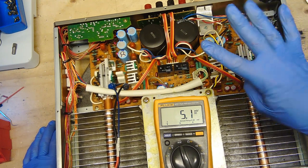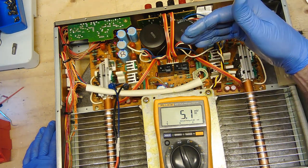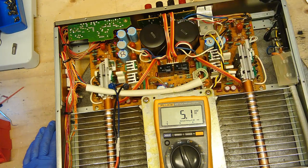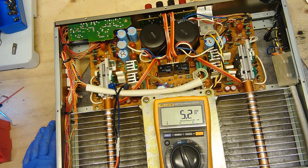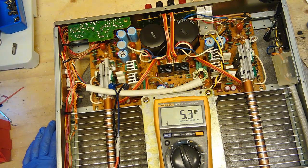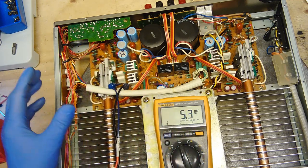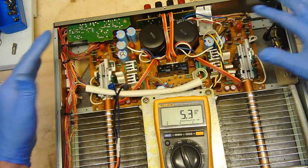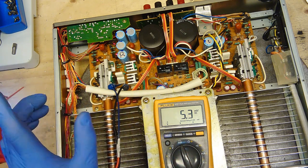Like I said earlier, there were three or four of them that were actually detached from the circuit board. It was still working. But if I didn't try to set the bias, I would have never caught on to this, because he was saying this was working perfectly when he tested it out. And when you start digging into these old receivers, you'll find that most of your issues are not parts. The parts on this are flawless. This is working perfectly.